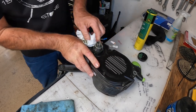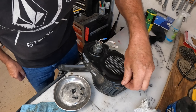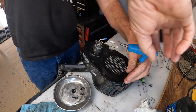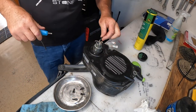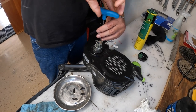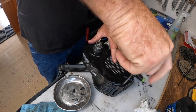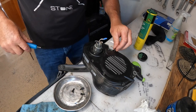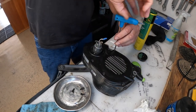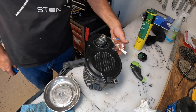Alright, so it's in. Now we've got our screws — dropping them in with a 4mm hex wrench. I'm not going to go crazy tight, just starting them. I'm going to work one directly across from the other — a crisscross pattern — you don't want this thing warping. Just go snug. Kind of like putting on a tire on a car or a truck. Sealed — time to install back in the bike.